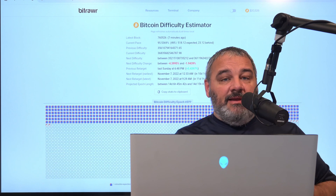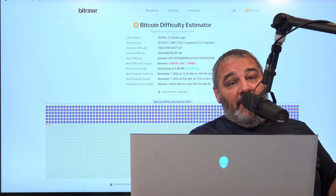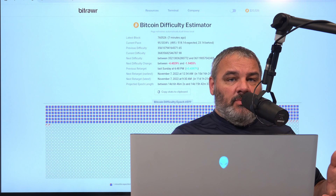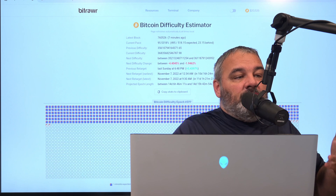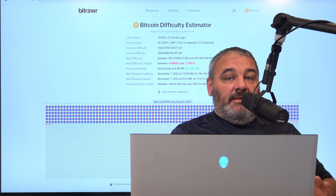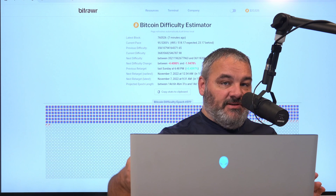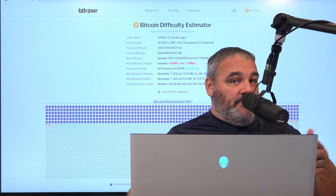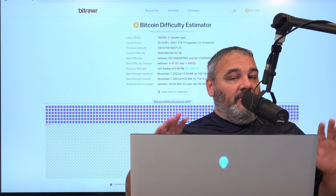Hopefully that helps if you're looking to make this change, whether you have 277 power or just want that extra overhead for overclocking. If you're in a colder climate and can overclock, these units will also run on 240, 220, and 208 — so you can upgrade the power supply without necessarily needing 277. They're just 277-compatible, giving you that overhead to get into 4,000 to 5,000 watts of power draw for immersion.